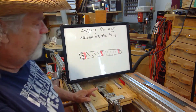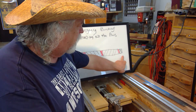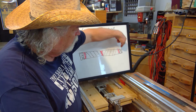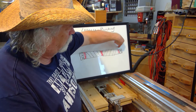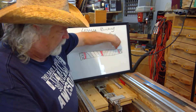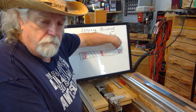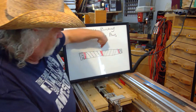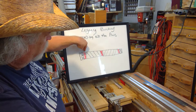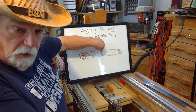The thing that you want to do is you want to be able to set this on the headstock end. You want to be able to put this in the machine and then you want your point of zero on your measuring to be right here, and you know you're going to come over an inch, two inches, whatever — you're going to come and start milling here. You want to make it perfectly flat here, here, and here on four sides, then transition and do your spiral here and here, leaving the center flat also.